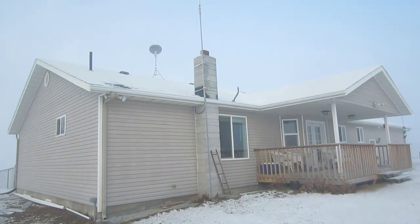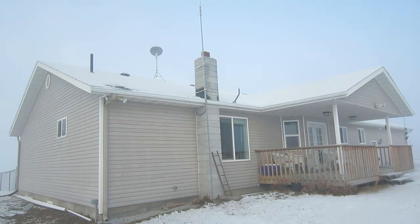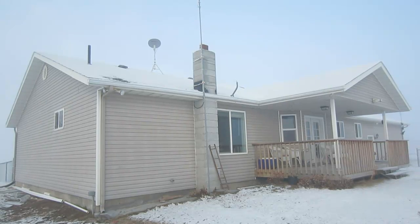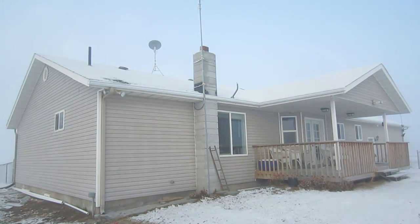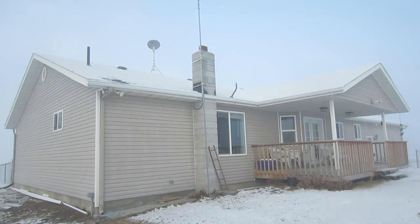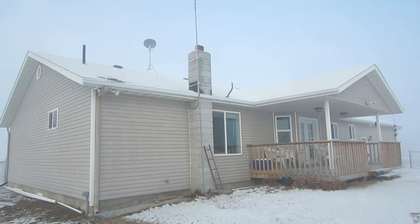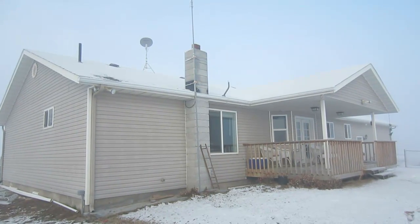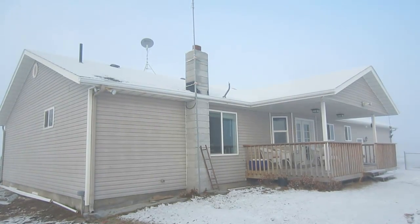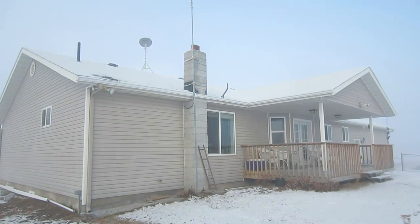The advantage of a roof mount is that the panels are out of the way for safety — you're not going to have many children climbing up on your roof to play around with your solar array. Right now it would not be very safe for me to be climbing up on my roof to try to get snow off of the panels. Another advantage, if you've got a clear view to the south, is that you don't have to take up any ground space. So if you have smaller property or fencing or structures that would cause shadows, having them up on the roof may avoid those problems.